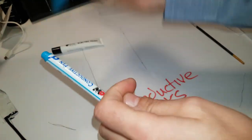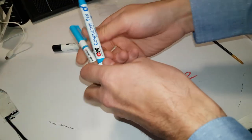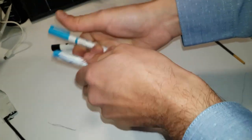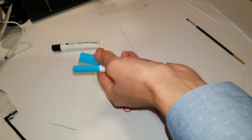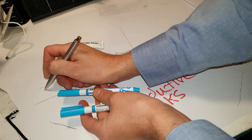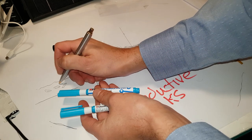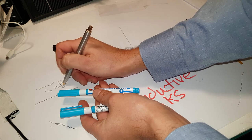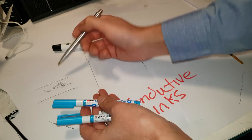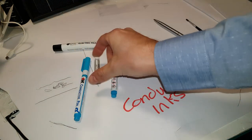These blue pens need quite a lot of shaking. Once you've got them warmed up and going, you can actually hear a little ball bearing inside moving up and down. If you can't hear that moving, you're not mixing it well enough, or maybe the inks are too cold and too stiff - you just want to warm them up to maybe body temperature. These things rely on little pigments suspended in some sort of glue or paint. The paint itself isn't conductive, but there are little pigments, molecules, crystals, flakes - certainly with the silver one there should be little flakes of silver suspended in it. You really need these little flakes of silver touching each other so they can create an electrical path. If they're not well suspended in the ink or paint, you're not going to get a complete circuit, so you really need to mix these things up well.